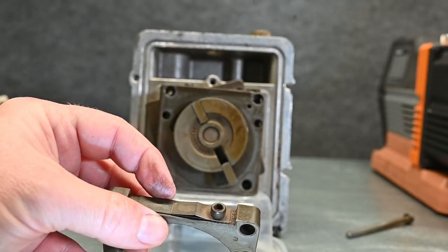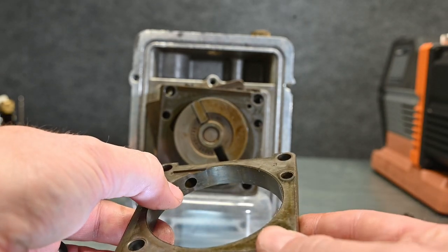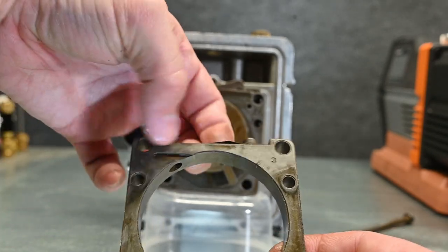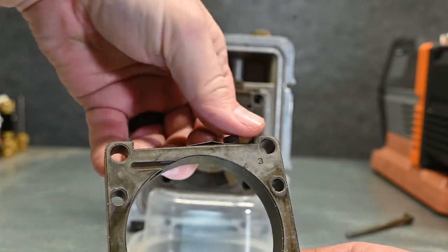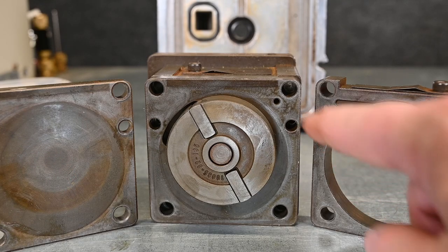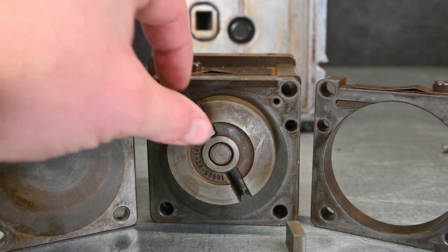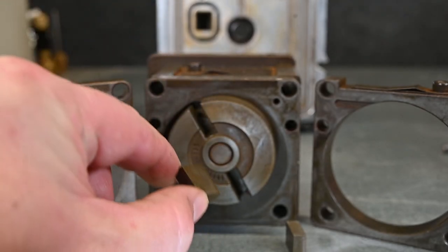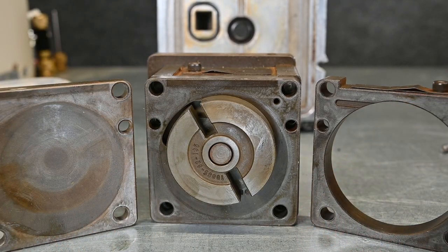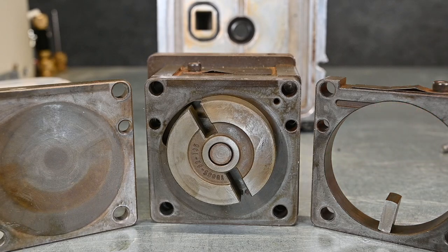At the top side you can see the little reed valve and the exhaust port right here. When it squeezes, it exhausts through that little chamber and right out through this little reed valve. You can see the guts inside — the end plate, the side, and these little vanes. These are the ones that spin out as centrifugal force acts on them. They're curved on the edge, and that curve is very important so that they make proper contact with the outside of the pump. That oil is essential — for preventing metal grinding, for keeping moisture out, and for maintaining that seal. I can't stress that enough.